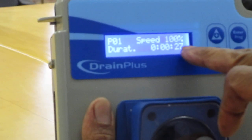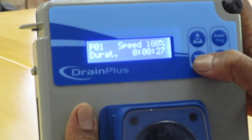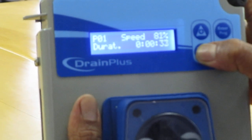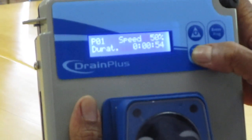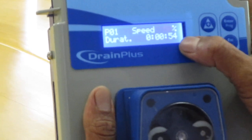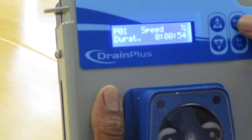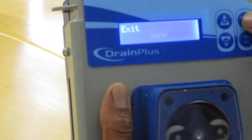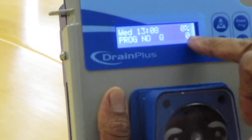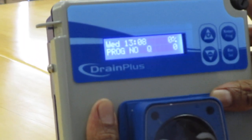It will take 27 seconds to do your 100 mils. If you want, you can take it down to 50% — at 50% the duration shows it will take 54 seconds to run. You press enter, then always press escape and it will ask you to save. You press save, so that time is now locked in. Because if you don't save, you lose the dosing time.